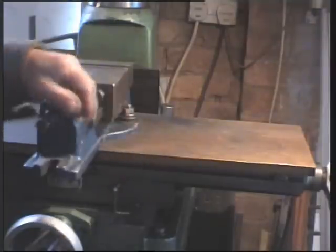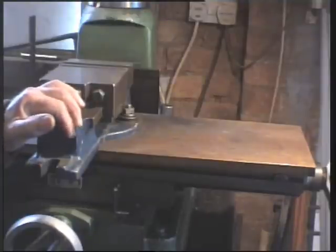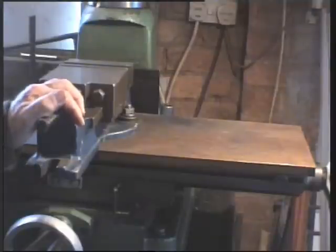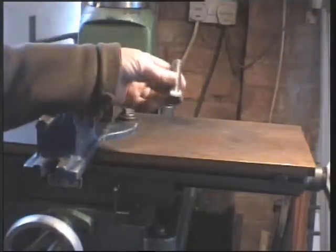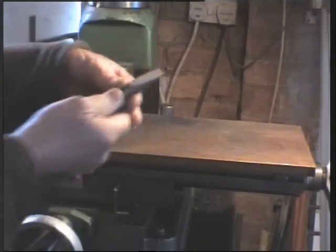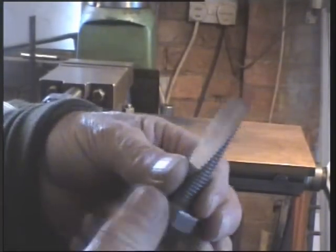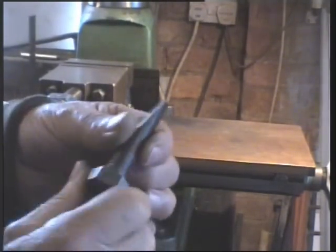But I didn't know what to expect, and whilst I could clean bolts and threaded parts with a wire brush, I had no means of cleaning in the threads. I didn't have a tap that I could run through and clean them out. But he had a rudimentary workshop, and he had a few bolts that were spare of the size, so we took one of the bolts and we filed a flat on it, so I can get in close. And if you machine, file, grind that shape, you'll find it really handy for cleaning out the rust in threaded sections.